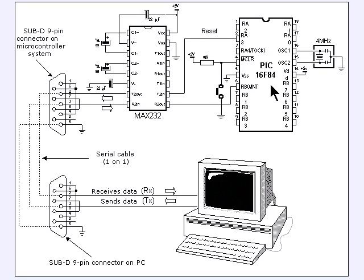These microcontrollers operate off of 5-volt logic, but these serial ports don't operate at 5 volts. They operate at a completely different, incompatible voltage. So you need something like a MAX232 for a serial port that will convert this plus and minus 12 volt DC signal to 0 and 5 volt TTL logic.